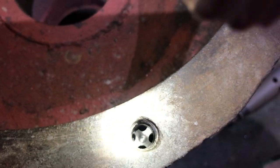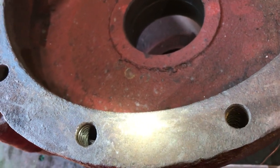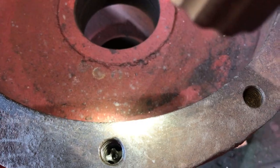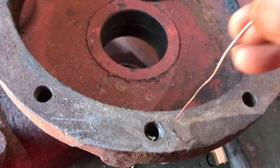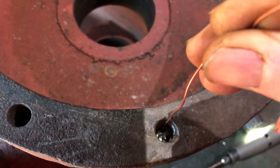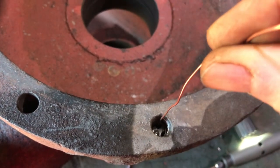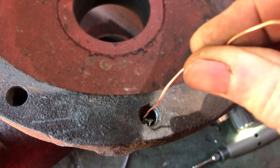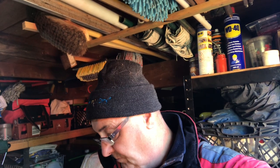Quite a ways down but we're getting there. I've got the top part cleaned, just need to get rid of that. Now I'm going to go in there with my piece of wire down the back of that hole. There's an obstruction there - come to that front hole, see how much further it goes in. There's an obstruction in that flute, and an obstruction in that flute. My feeling is that's when he backed it out - I think he went in, tried to clean the thread out, the flutes jammed up with crap, he backed it out and it went solid and snapped off straight across the top of that casting.